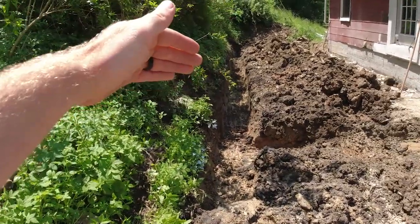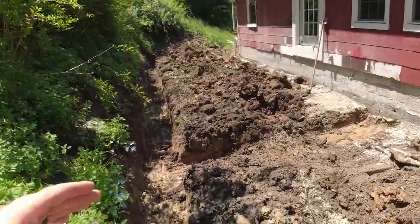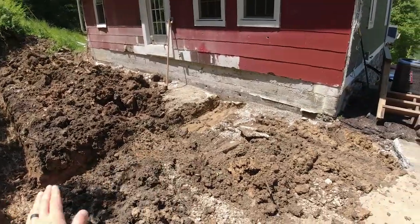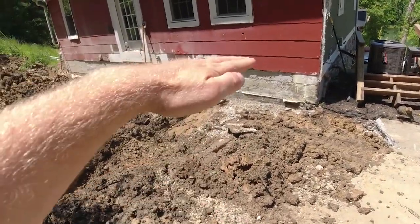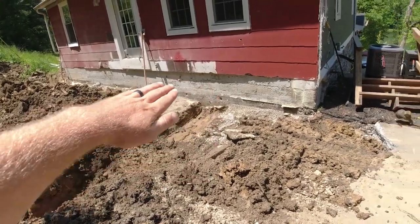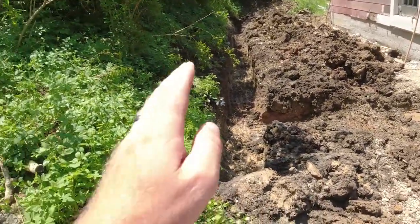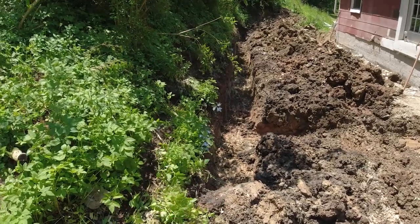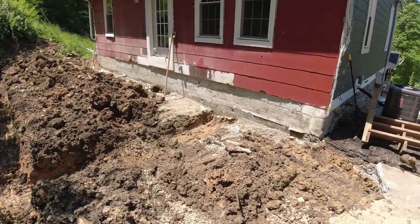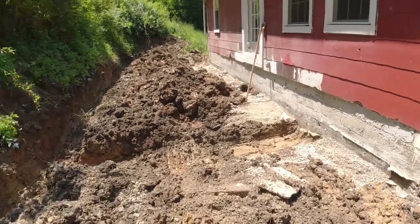If we don't have a wall there, because we're creating this corner, this little bump out here, now we run the risk of having water come down this hill and go across the driveway. Now, I know we are picking the floor up, what was that, like 16 inches or something? So there is going to be a good bit of slope coming out, but just as an added safety precaution, I would like to have another wall here. That way, like I said, just a little bit extra insurance that no water is ever going to be sitting up against the house again.